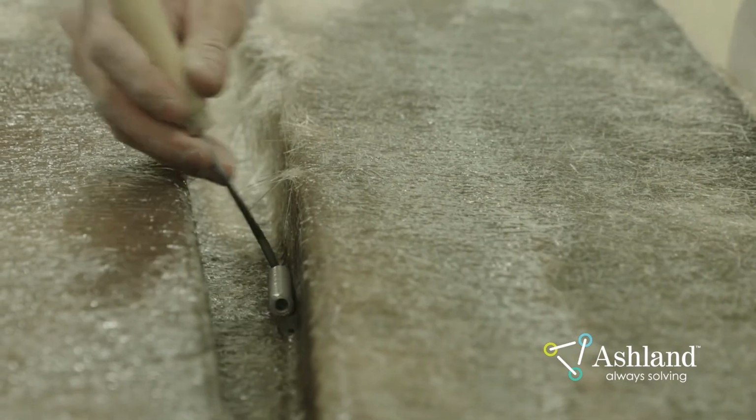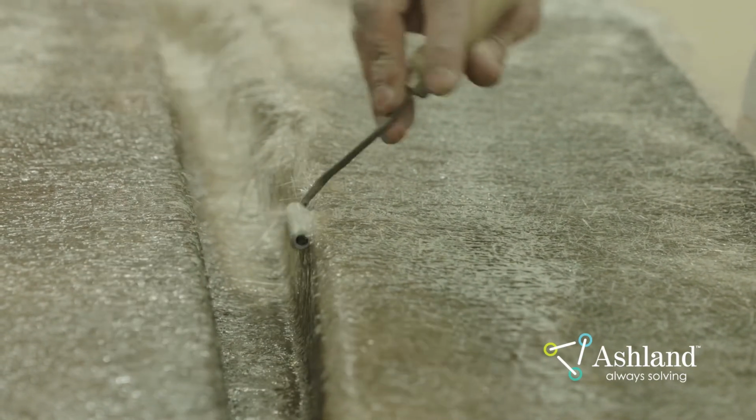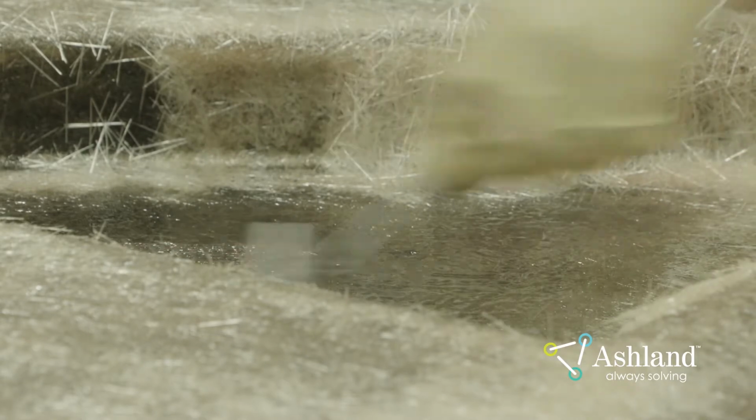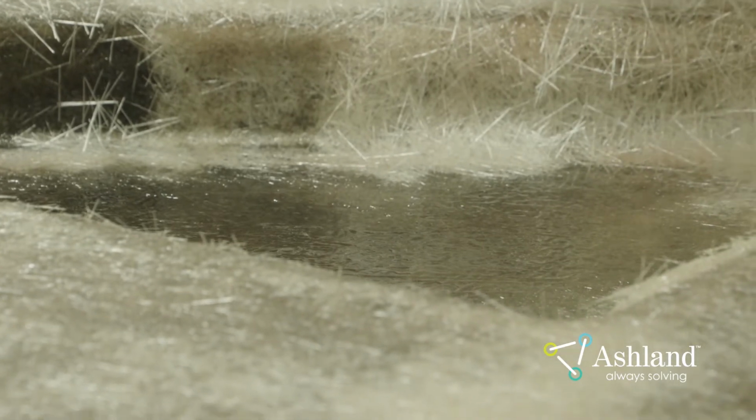The diameter of a roller is as important as the type. There are various diameters, which will fit into different radii of the part surface. Using a roller with a larger diameter than the radius that you are rolling will cause resin to puddle in the radius next to the gel coat. This will cause excess shrinkage, which in many cases leads to print problems and heat lines. This resin-rich area can also lead to a weaker part of the laminate that is prone to cracking.